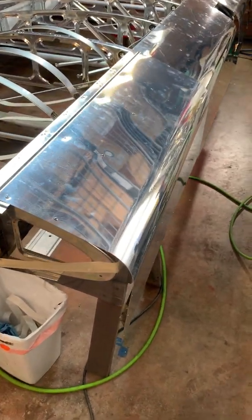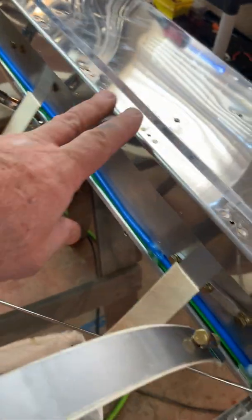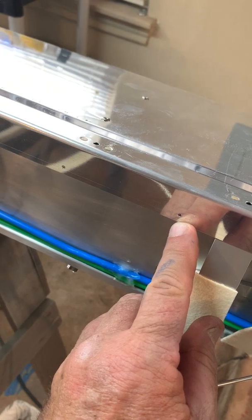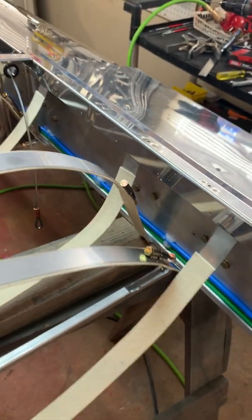This will be the last thing to do. We got this side of the skins up and made sure we put a clamp there so we had it down flush. When completely finished, we're going to come back and put the same rivets into these holes here. These are pre-drilled holes and they work perfectly as long as you've got the bottom of this skin flush with the bottom of the spar bulb right here.